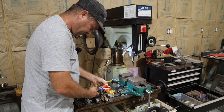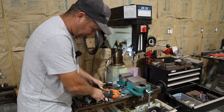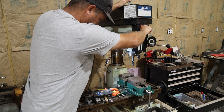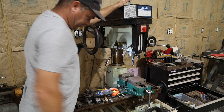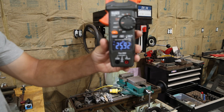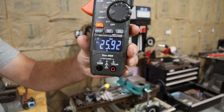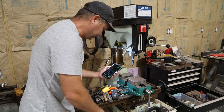This milling machine has a two horsepower motor, so we're going to see what the surge is on it. Plugging it into the Mega One — we got a higher surge that time: 25.92 amps. 25.92 amps times 120 volts comes out to 3,110 watts.